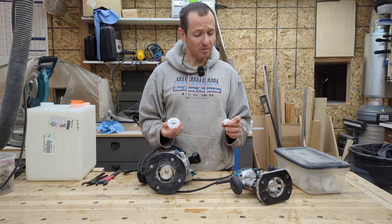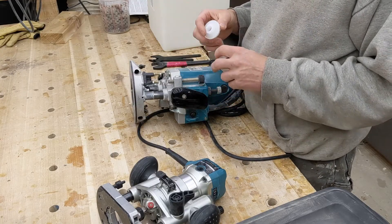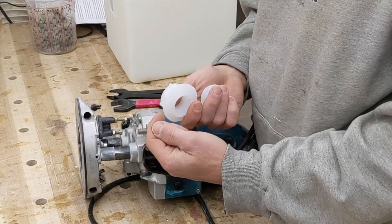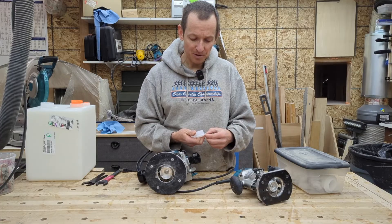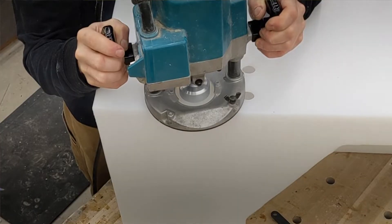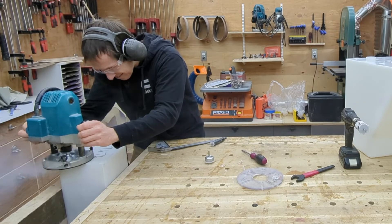The installation process really is that easy. You just find where you want to locate your fitting, drill a hole corresponding to whatever size fitting you're installing, put the driver in your router and start it up. You'll quickly see a puddle start to form around the fitting as you're plunging it in — give it at least a couple of seconds when that's happening. On these fittings there's a flange, and ideally you want it about flush with the surface of the tank. I err on the side of slightly under-driving it so the flange is just slightly proud, because if you go too far you'll blow the fitting through the side of the tank. Give it a couple seconds to let that puddle form and get a lot of nice molten plastic there, because once you stop the router, things cool pretty fast. Once things cool, this is just a welded, seamless fitting — extremely durable.